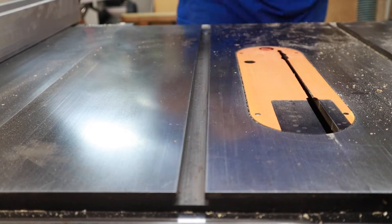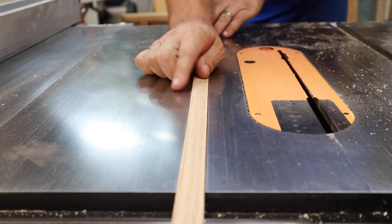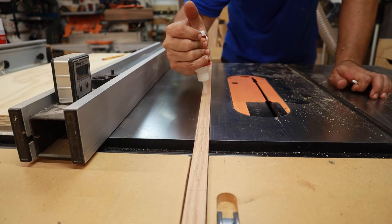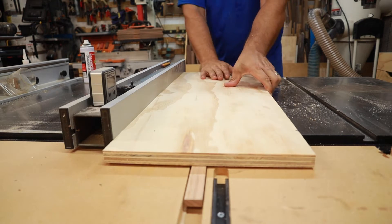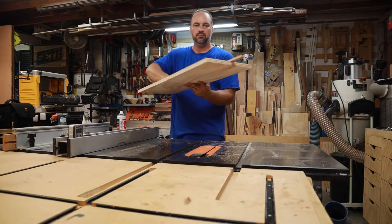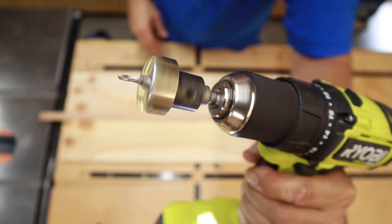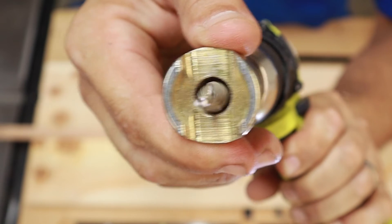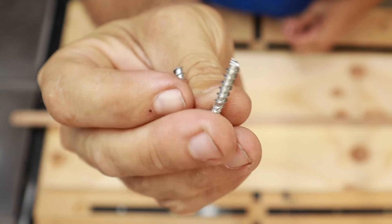If you've ever made a sled for your table saw, you're probably familiar with using pennies or washers in the slot and laying the runner down so it sits just a tiny bit proud of the surface. To get the initial bond between the runner and the plywood, I'm going to use some CA glue on just the runner. Then I'm going to spray some accelerator on the plywood so when I lay the plywood down, I'll get a good fast bond in just a few seconds. This holds the runner securely in place until I can seal the deal with some screws. I'm using one of my Amana countersink bits to drill holes in the underside of the runners — I love these countersink bits, and of course I'll have a link down in the description. I'm also using some screws that I had to cut down because I didn't have any shorter ones on hand, so I was just using what I had.